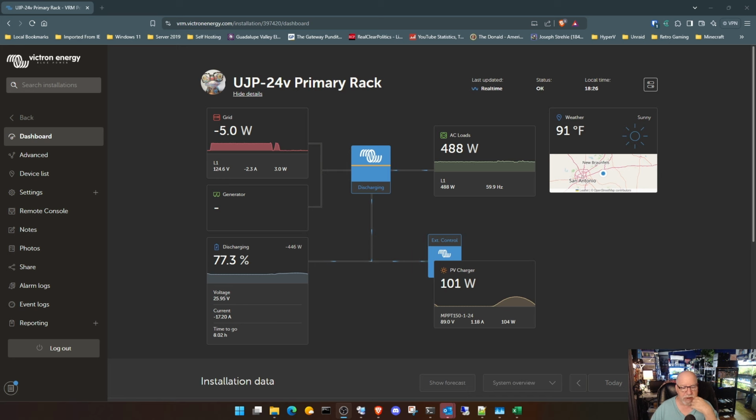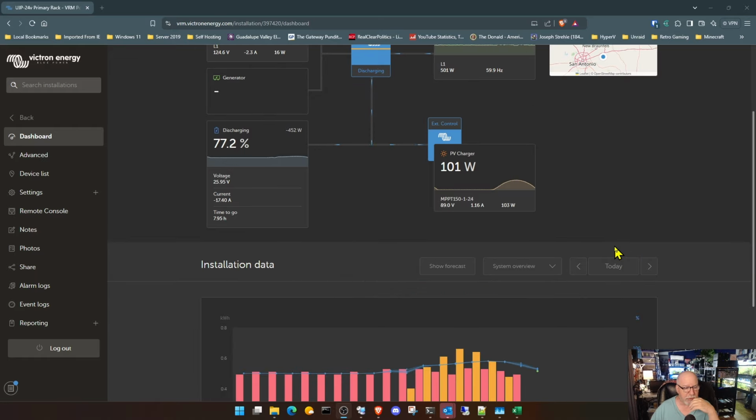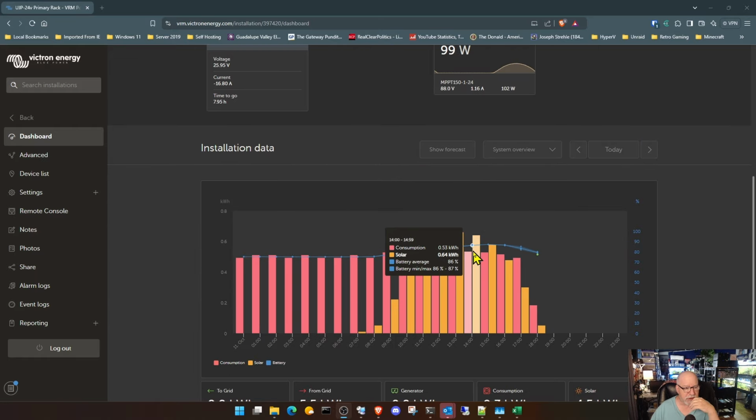Now keep in mind, it's about 6:30 at night, and the sun is quickly getting ready to set. It'll be set, in fact, in the next hour, I believe. So we're not going to get much more out of the PV, but it does power the load during the day. So I've got 5 200-watt or 195-watt panels out there. And at the peak, I think they're providing, well, let's go see. It looks like at the peak they're providing 0.66 kilowatt-hours